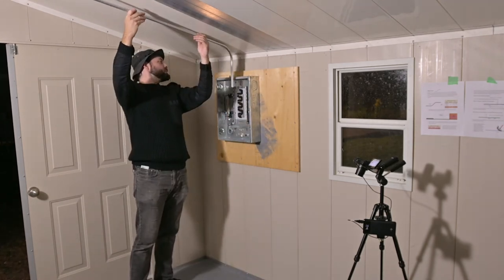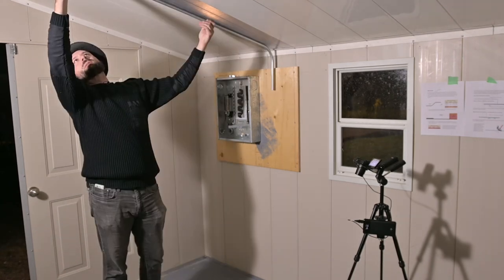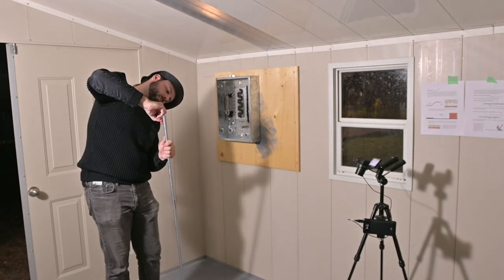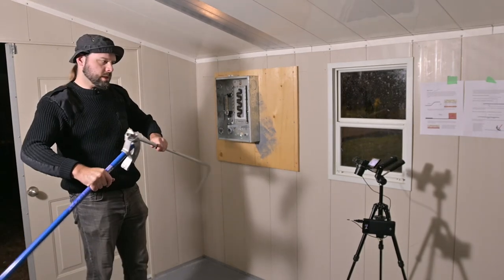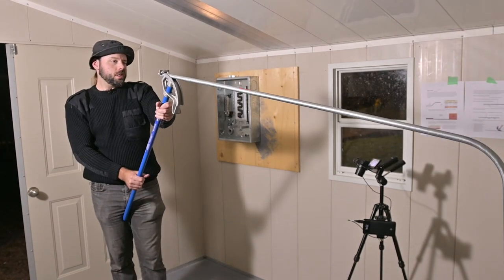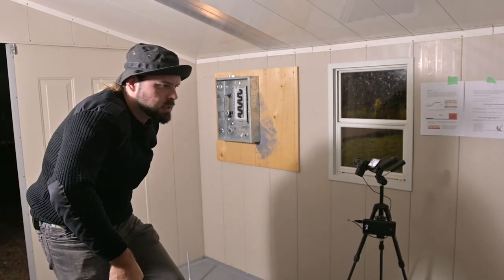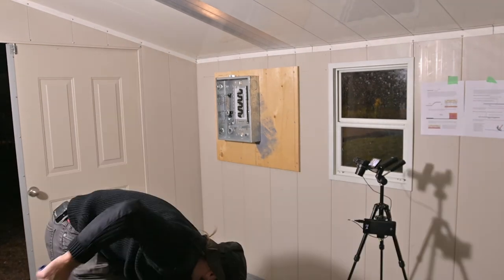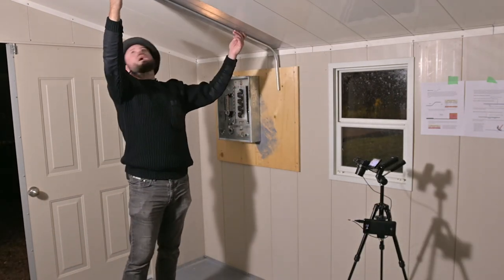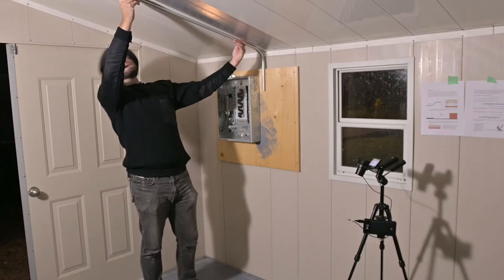I've definitely made it too long on this end. I screwed this up already — it's too short. Actually, it's going to be just right if I get this next bend correct. Not the most room to move in here. Got to make sure this is perfectly straight and in line. That's going to be the opposite. What's 90 take away 76? A 14 degree bend. Do we have that on here? We have 10. So if we go just over 10 — just a touch more. Yeah, I think that got her.